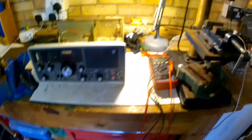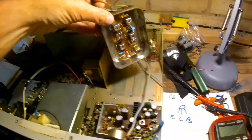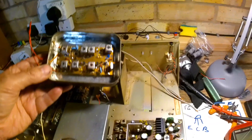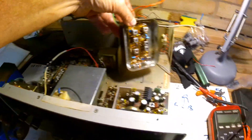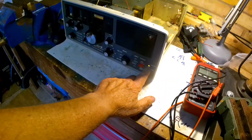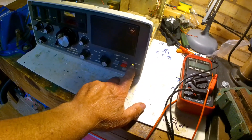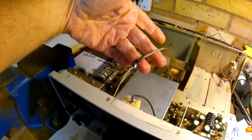It's got a few issues as you'd imagine. One thing I did find in it was this tobacco tin, and inside the tin there's a circuit board. This was wired in and I believe it's a down converter — it can receive on VHF, the two-meter band, and outputs on 28 to 30 MHz. I've disconnected it because I'm not sure about it. The other strange thing was the record socket here had 12-volt DC on it — a bit nasty if you plugged anything in to record without knowing that.